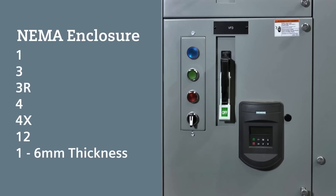With a panel thickness ranging from 1 to 6 mm, Siemens offers three different 3SU-10 operators only and 3SU-11 complete units in 22 mm operator designs, as well as a 30 mm flush design to meet all your application needs.